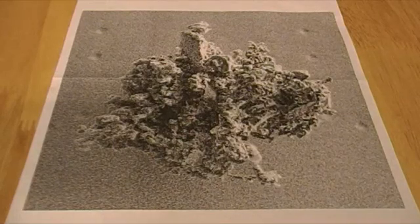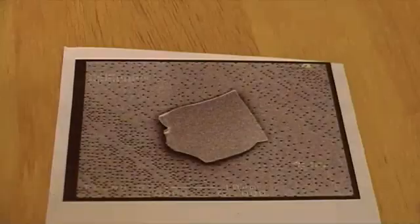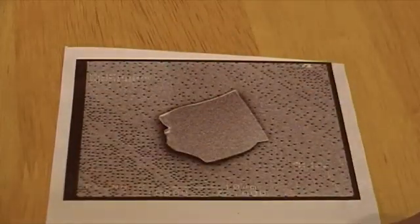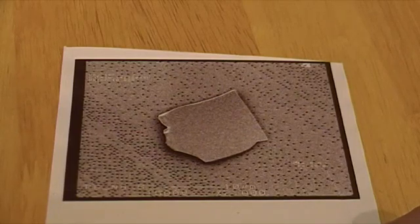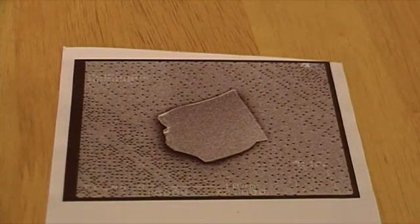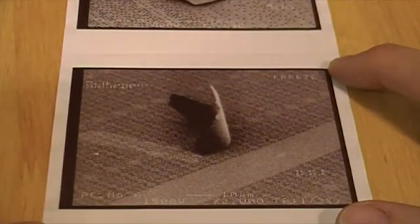Another group did scans that were not destructive to the wafer. They would pump it down in vacuum and then scan the top of the wafer to look for nasty defects like this one here. A few more examples of defects: all the little tiny holes you see are for metal plugs that go through this glass layer, which is an insulator between two metal lines. And this is a big old oxide flake — definitely not supposed to be there.